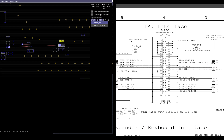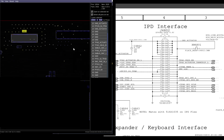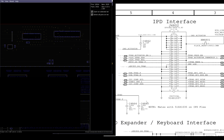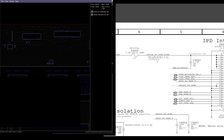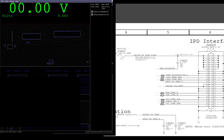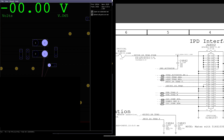So let's take a look at what I should be looking for on this board. This is going to be the trackpad connector right here — J4802. It looks like I need to have 8.6 volts on my trackpad fuse. We've got 13 volts there, so we're doing good.